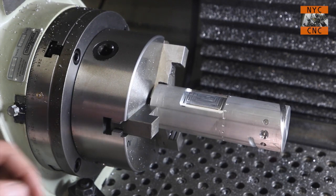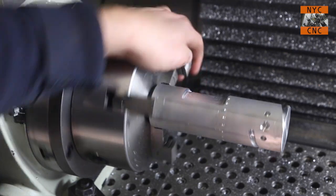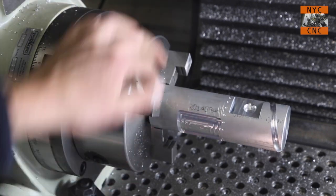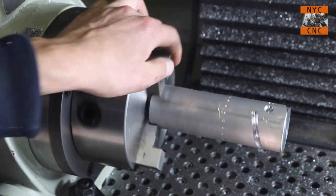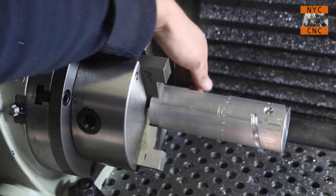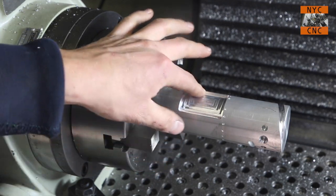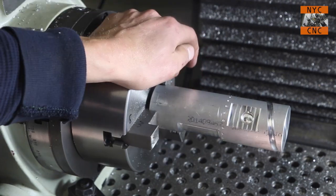This is the first part I've ever machined on a fourth axis. Oh my god, it is beautiful — I am astounded at the quality. And remember, I don't even have the right jaws in here, so inevitably there was more chatter or runout that would affect cut quality because I'm holding onto so little of the stock. Absolutely beautiful. I wish you could see and feel how smooth that finish is. One thing I noticed in SprutCAM: the smoother you want the bottom face, the shorter the stepover you need, because the edges are perfect but you get facets as you index the end mill over. Just beautiful, folks.